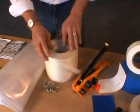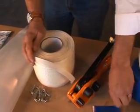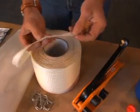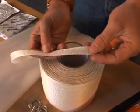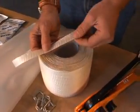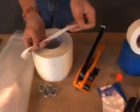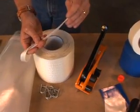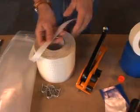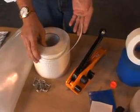Now, another almost a system all by itself is the strapping, buckling, and tensioning tool. And these 3 items are what is used to install this woven cord, polyester cord strapping on the boat. This forms the support structure, and this also goes around machinery and boats as a perimeter band holding the shrink wrap on. So this is very strong. It's 1,200 pounds tensile strength, and it has no stretch. So by using this in the buckles, you'll see how we do that. And the tensioning tool, you can make a very tight strapping system that's easily installed and very strong.